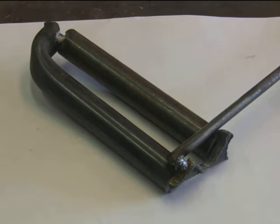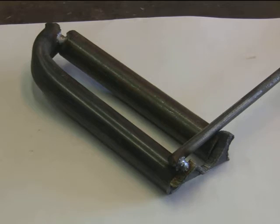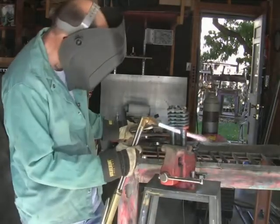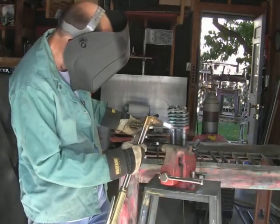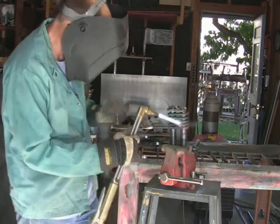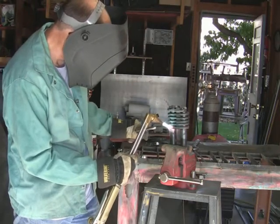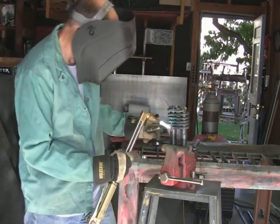The jack-in-the-box consists of a 3/8-inch diameter steel rod. I'm bending it around two 1-inch diameter pipes that I tack welded together, and I'm going to be using an oxy-acetylene torch to bend it around the pipes. I chose the two pipes because as you bend that hard steel rod around them, when everything cools down, the rod is going to tighten up around wherever you bend it, and so you need some way to disassemble whatever you bent it around. By having those two pipes tacked together, I can just grind the welds out and disassemble it.